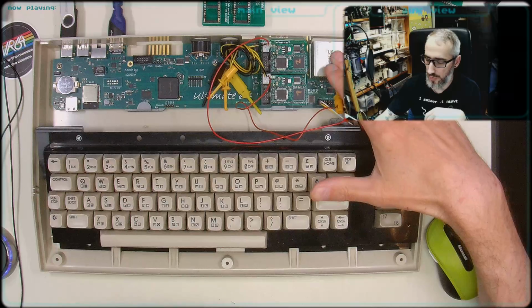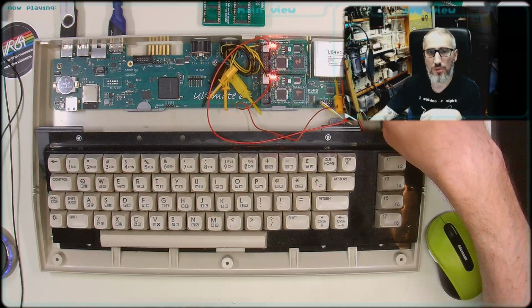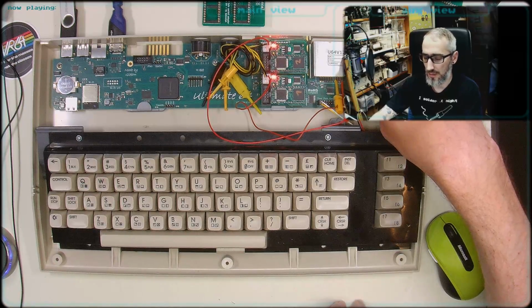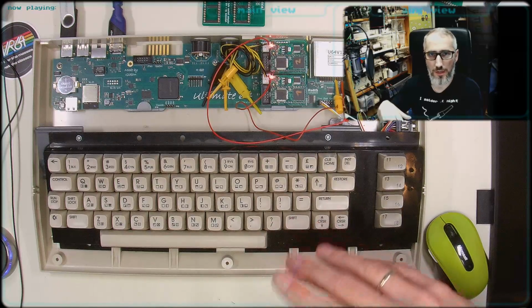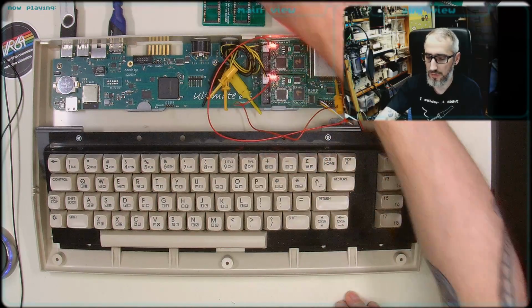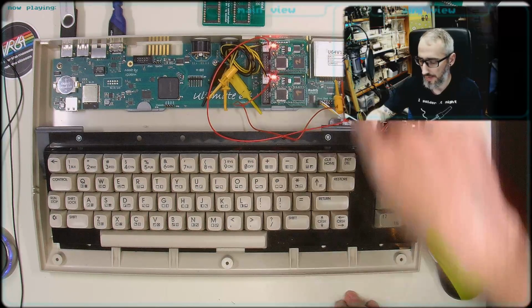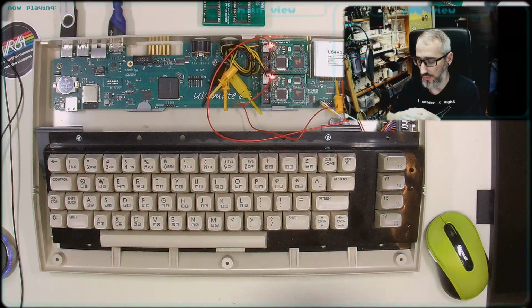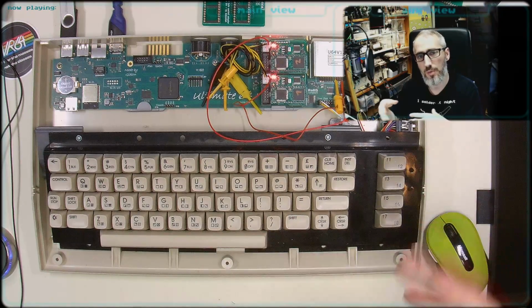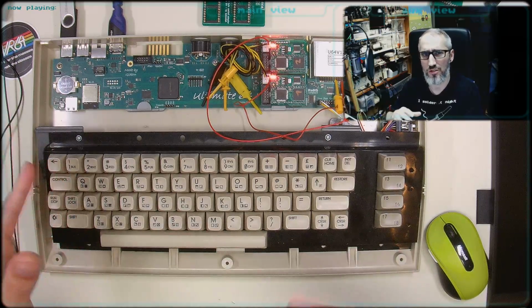But on the I/O port, or on the expansion port, whatever we want to call this, cartridge port, we have the so-called I/O signals, I/O1 and I/O2. And these signals are generated by the board, usually when you write data to a certain address range. And these signals can be used as a chip select signal, and therefore we connect the red wire, as we did for the first adapter, to our expansion port to pin 7, respectively pin 10. And this kind of method has been used by people since the 80s, so to say. So this was probably the first version of using additional signals to play with more than one SID. If we just exclude stacking SIDs for a while, which is perhaps not a very elegant solution.